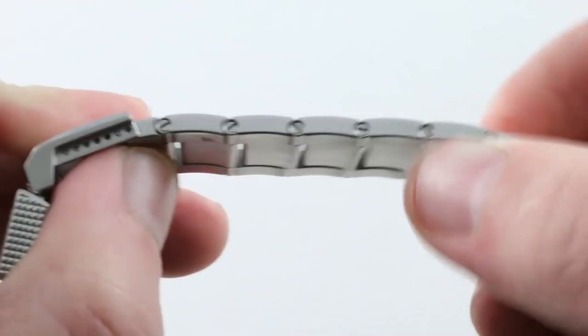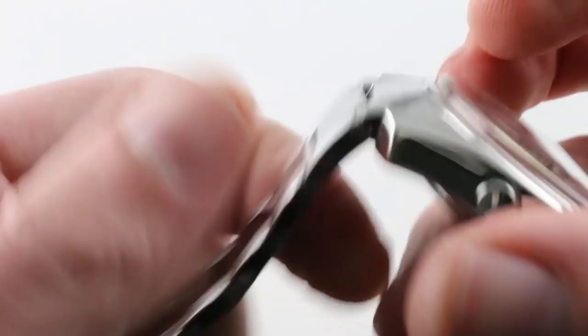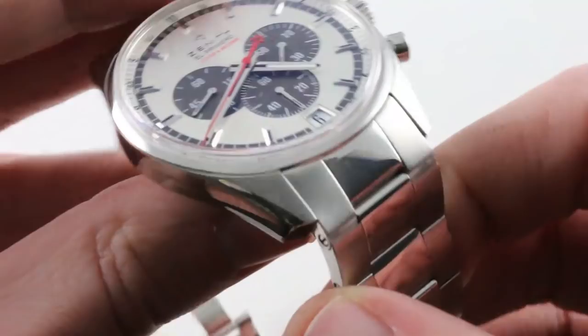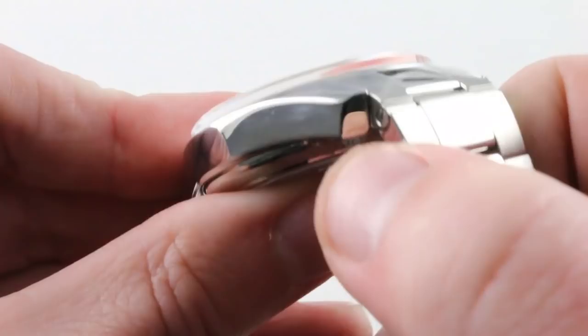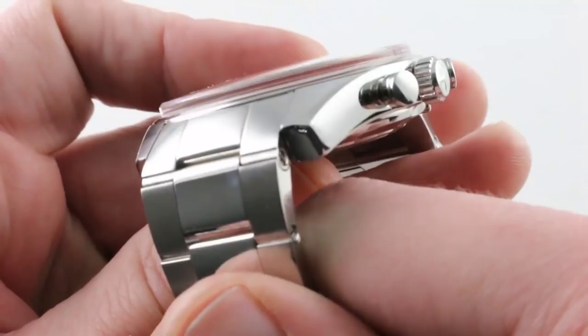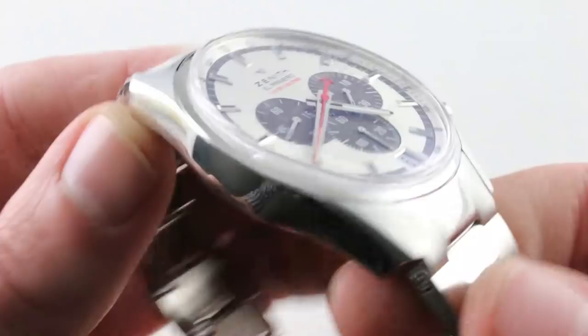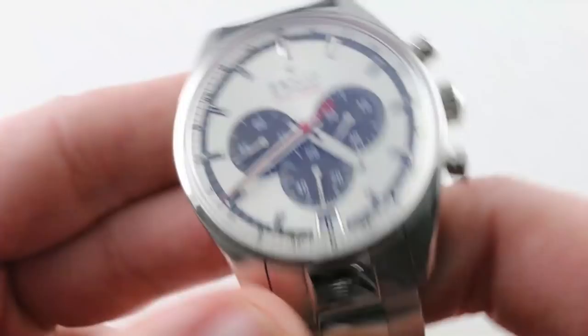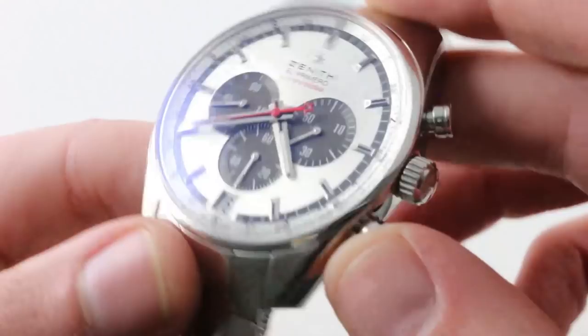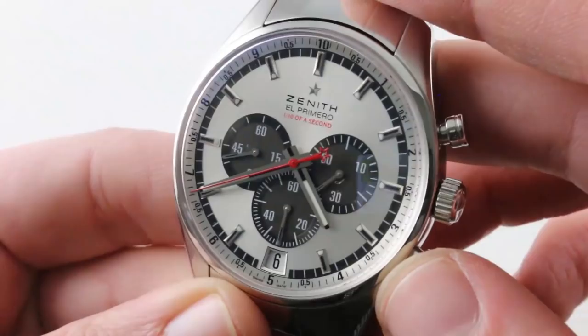The case is simple but strong, with a somewhat inwardly sloped and handsome compound curvature about its fully polished side. It's not a thick watch. The lugs are a hybrid, with a satin finish on top, a transitional bevel that flares at the edge, a squared-off somewhat downturned reverse ducktail at their outer facing. There's a sharp, masculine character to the lugs, whereas there's more of a sinuous, curvaceous form about the mid-case, so the watch is well-balanced. The bezel is quite minimal — basically a silver halo outboard of that dramatically sloped and cambered box-section sapphire, making the watch essentially all dial. Box-section sapphire is expensive to make and spec; Zenith could have gone flat but instead chose the most expensive option — no corners cut.